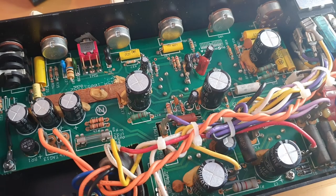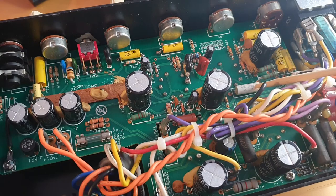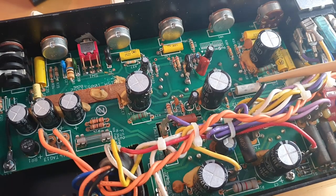I took some time to analyze what we have in here. In a previous video I said it looks really nice, but I have found some things that are not looking nice. One thing I mentioned already is this power resistor, which is on the secondary of the power transformer and limits the voltage that goes to the circuit. But there were a few things that were changed by someone — someone's been here already. This cap says 22 microfarads, 600 volts.